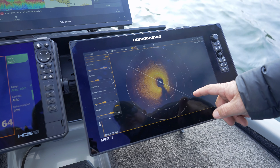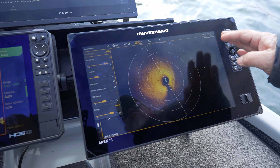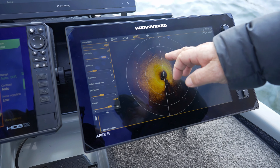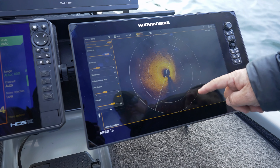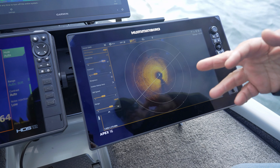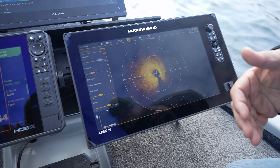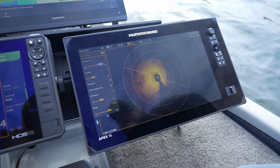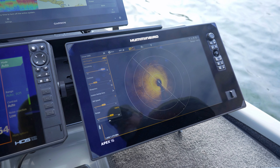Contrast I play with, because I want it to be able to show detail. Right here you can see how light this color is — we've got rock up here in front of us. Over here to the right it's dark, which just means it's falling off; we're coming off a little road bed right here. You can see the detail of the rock pile right in front of us, the drop off, and the deeper water on this side because of the black. You can turn contrast sensitivity up and down depending on the bottom source you have. The harder the bottom, the less contrast sensitivity you need. The softer the bottom, the more you have to go up with it — if you don't, you get a really black picture. I like keeping it a little bit darker so I can see the contrast on the bottom better.